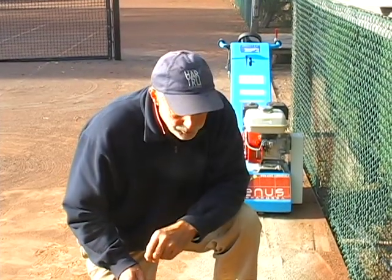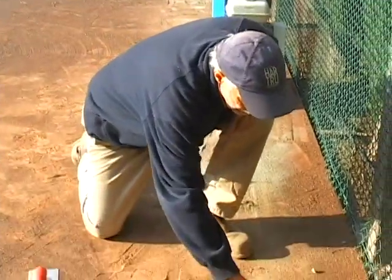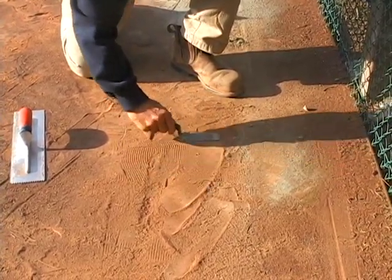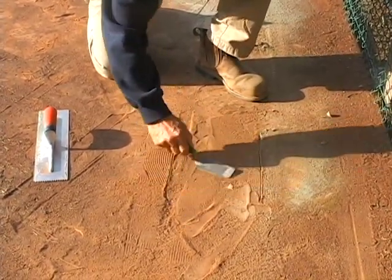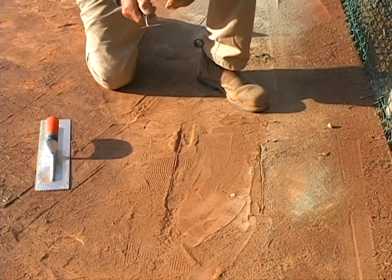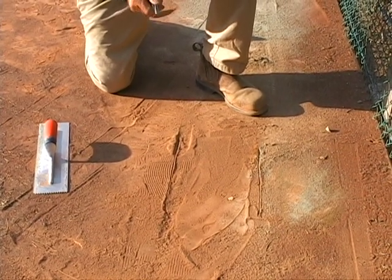We're back on the surface. We've made a pass with the machine rotavator, and this is what we have. On this side we have the hard surface with a little moss buildup — you can hear the sound. Now on the other side we have nice powdery material. After that single pass, we're back to nice powdery brick dust material, which will be broomed. The whole court can be done this way. We broom the court, water it, and the court is complete. All the hard areas, moss, and algae are gone and the court is ready to play.